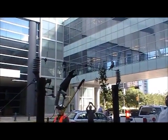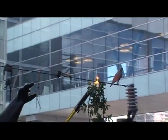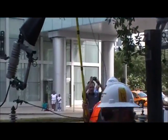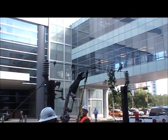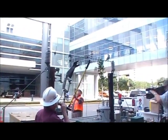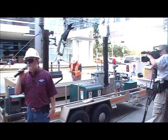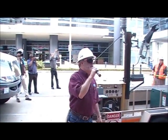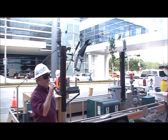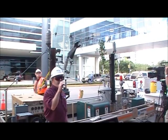Greg is going to bleed off the capacitor to make sure there's no voltage still in the line. He's going to put the grounds back on. This is not considered safe until he has returned all the grounds to it. As we say at CenterPoint Energy: if it's not grounded, it's not dead. Remember, after the hurricane there will be a lot of wires down on the ground. You want to stay away from those wires. Don't try to move them yourself. And remember, anything you're in contact with can also be energized, and you never know when the circuit is going to become hot again.